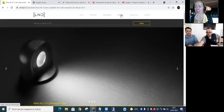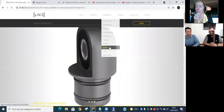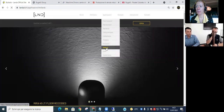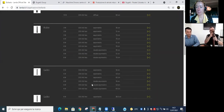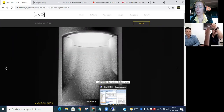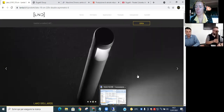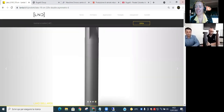This product has been in the range roughly five to six years and has recently been given a big brother. This has a backwards-facing LED in the top of the fitting that shines downwards — it can be either single or double emission. This is the little brother: you can see a diffuser and an LED circuit board in the top. The big brother version has a head that is 13.5 centimeters against 52 millimeters on the small version.